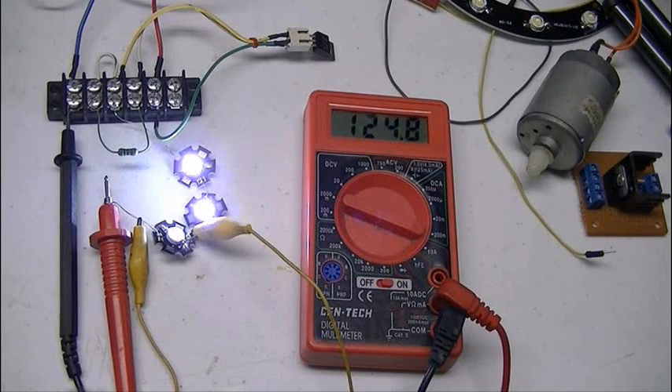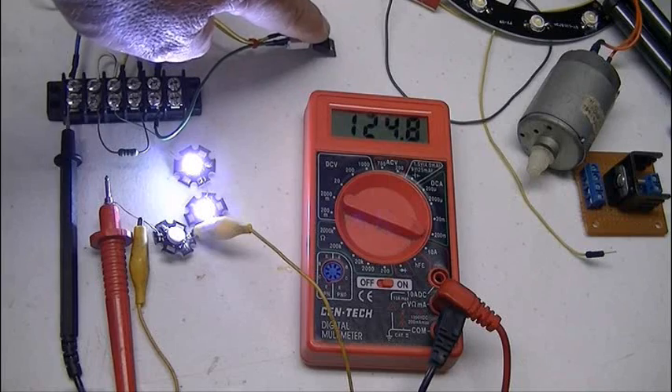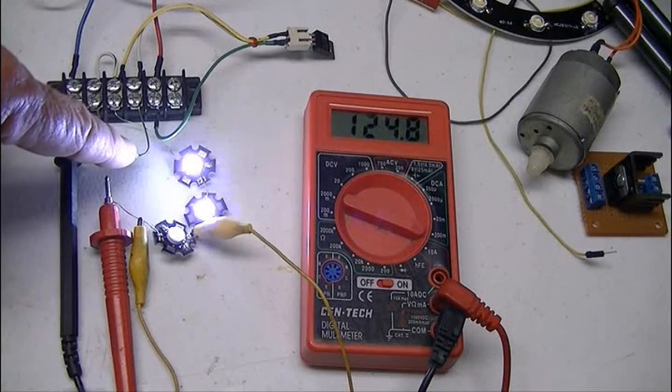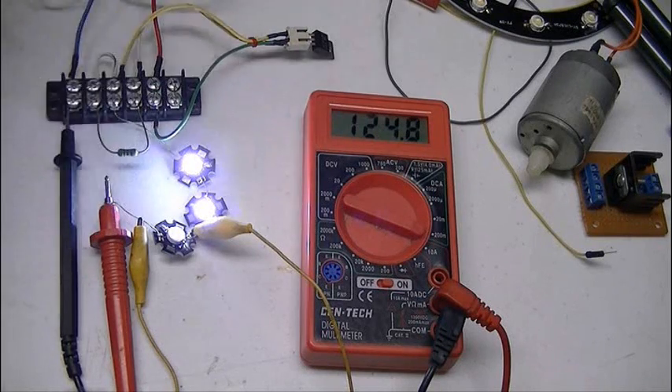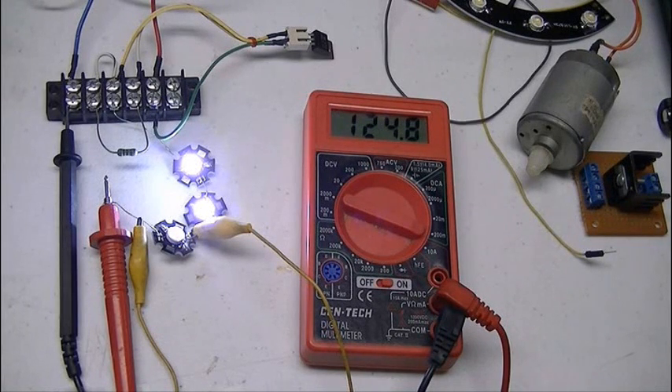You can see it here, and those LEDs will blind you looking at it. This circuit has a formula — it uses a 10-ohm resistor. You divide 1.2 by 10, and that gives you the current output: 1.2 volts divided by 10 is 124 milliamps. What if you needed a constant source for 50 milliamps? Divide 1.2 by 0.05 and you'd need a 24-ohm resistor.